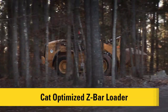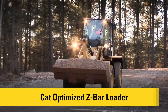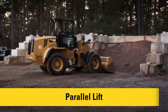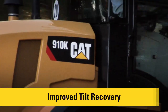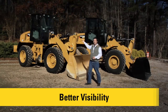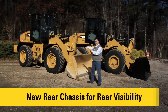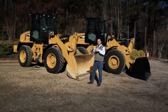We've got an all-new loader front end that is just like our bigger wheel loaders, the K-series family. We have an optimized Z-bar loader linkage that helps us get more into the pile, get faster cycle times, and have a lot of parallelism for fork work. It also has better tilt recovery to keep the load solid as you go up and down the range. We also have a new cab on board that gives us better visibility all around, front to rear. We have a new rear-end engine frame and the engine is now longitudinal with the machine versus being crosswise or transverse. That helps us get better visibility to the rear end and helps with our design to create a more stable machine with better tipping loads.